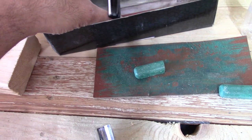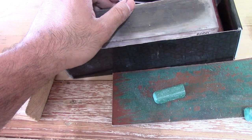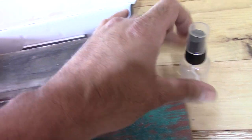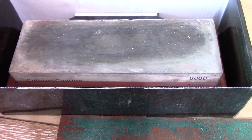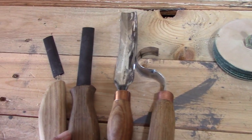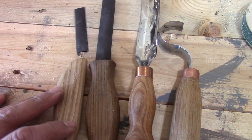So if you don't have a diamond automated grinder, this whetstone is the other way to go for sharpening. It also came with a little bottle, because you're supposed to soak the stone in water for 15 minutes before you start sharpening, and then use that bottle to spray it to keep everything wet. Okay, so off to the wood carving tools.